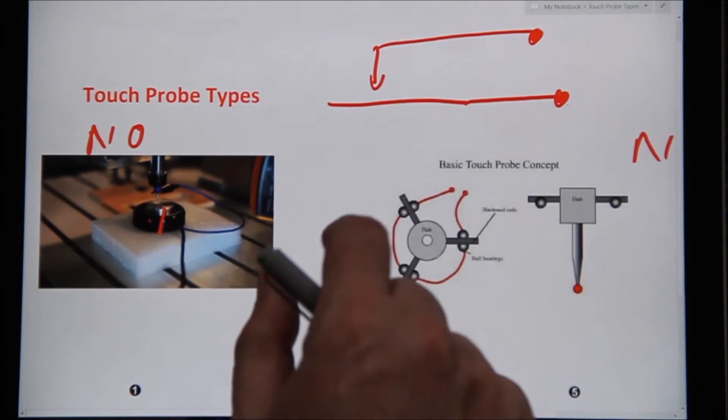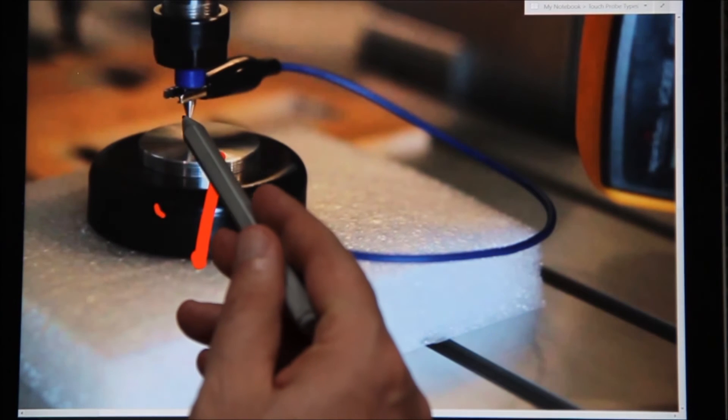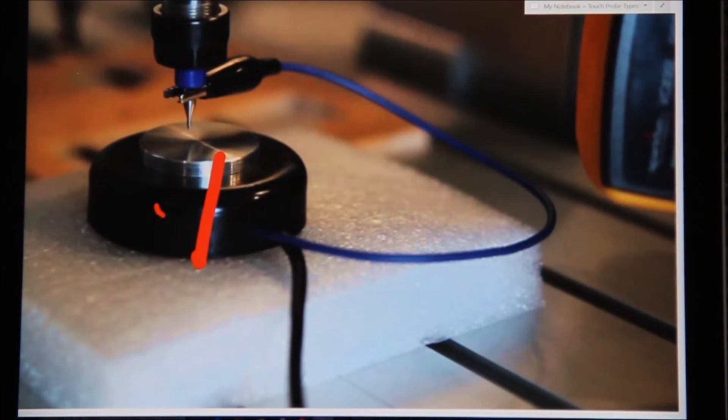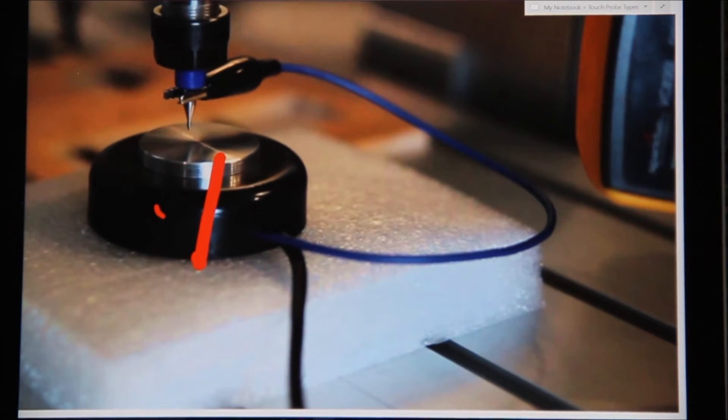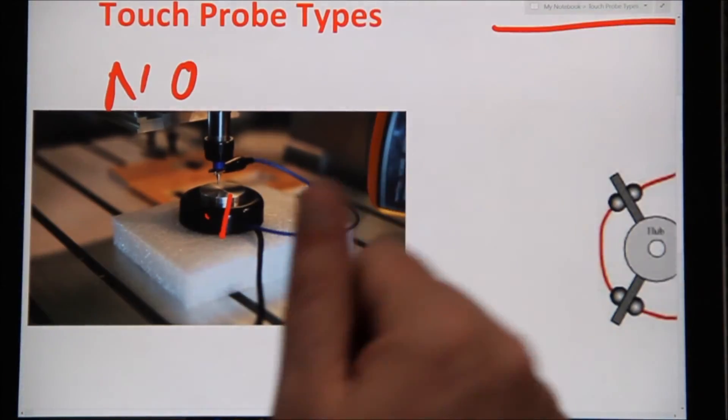I hope that helps give an idea of how to do these. When you do lots of plasma cutting there are lots of dust and sparks, and over time the plasma residue that gets onto the tip is not conductive, which means it doesn't register that it's touched the metal and the machine can crash. One way of getting around that is to use what's called a floating head. I've just done a video before this that shows the floating head — this approach is great for pieces of work like this.